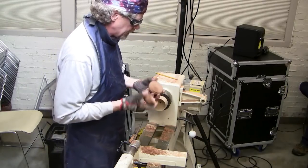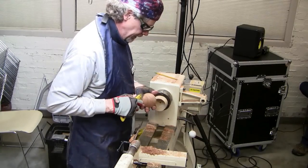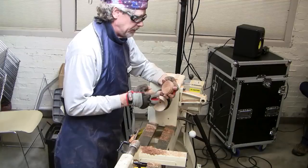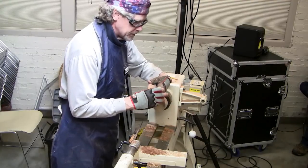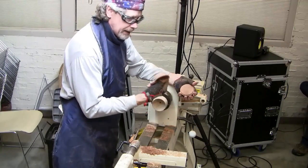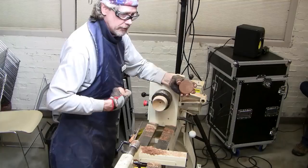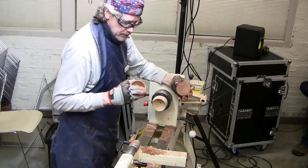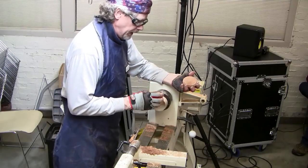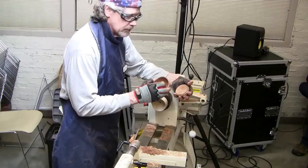So I've got a half-and-half box now. What I would have done if I did have it that tight — before I had finished the bottom part — I would have sanded this just a little bit. Before I would have taken the top off, after I'd hollowed it out, I would have sanded the inside, I would have finished the inside, and everything would have been done before that came out and I worked on the other half. So that all would be done because there's no way to go back to the inside and do a finish. Things like this I'll finish on the lathe, so that all has to be done while it was still in that orientation during the hollowing part — so right after the hollowing was done, sand it.